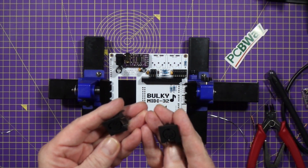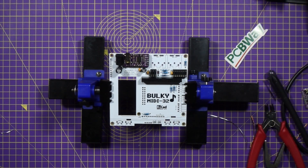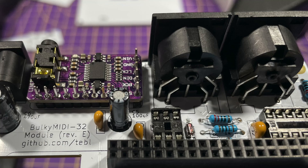At this point I'm going to add the two sockets for the MIDI connections. One thing to bear in mind is that there are some larger tabs to be soldered, and I recommend sticking as much solder as you can on them, because there could be a bit of stress on this connector from inserting and removing MIDI cables. Once they're soldered, that's pretty much it for the main board for now.